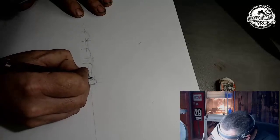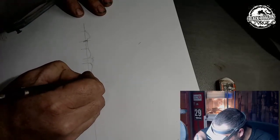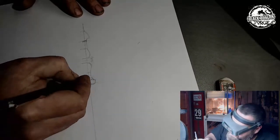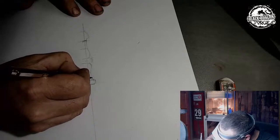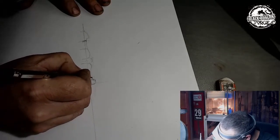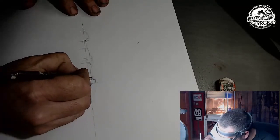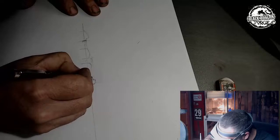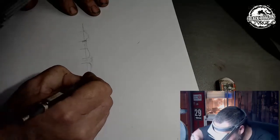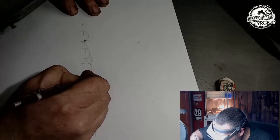I want to do at least a step of some sort. So if I'm going to do a hollow, I prefer that to be 3mm wide for the sheer fact that I have a 3mm round file. So it's easy to do that transition. Then on that transition, we are going to step it up, just one single little step, just so that I've got symmetry on both sides of my transition.